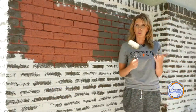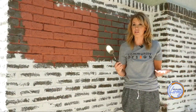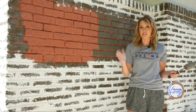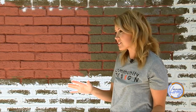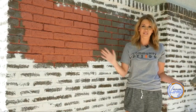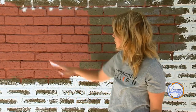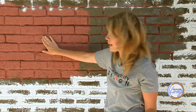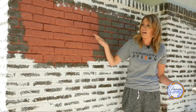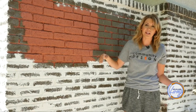The first thing I'm doing is just rolling the paint on the brick because I want to cover most of the surface area. You can use any color paint you want. I think three colors is a really good mix to make it look brick-like without doing too much work, because a lot of it's going to be covered up. When you're picking your colors, you want to make sure that the color you want to be most prevalent is the last color you apply. I tried it a few different ways around my house and I feel like starting with that dark gray as a base works really well. Make sure your brick is cleaned off — I used a shop vac and a little brush just to make sure I didn't have any bugs or loose debris on there before I started.